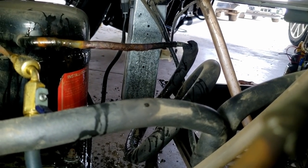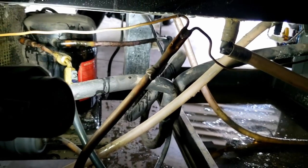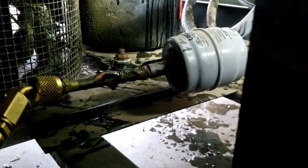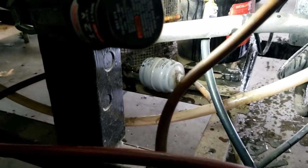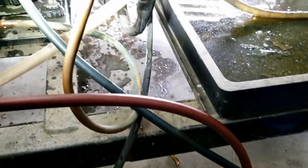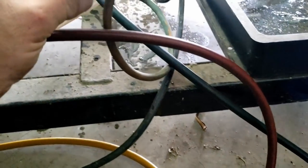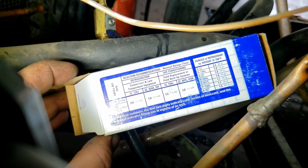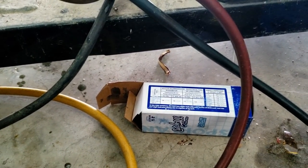That's going to make it a little rigid if you had to bend it, but you've also got to look at the condition of this cooler — it's not in the greatest shape and definitely has some age on it. The filter dryer is a three-eighths inch — it's a small one. They had to jerry-rig a port on it just to connect gauges, which kind of sucks. I was able to find a three-eighths one — it's a 33 versus the old 53, but in all reality it should handle it no problem. It's 134a, quarter-horse — the filtering capacity won't be completely there but at least it'll be fresh desiccant.